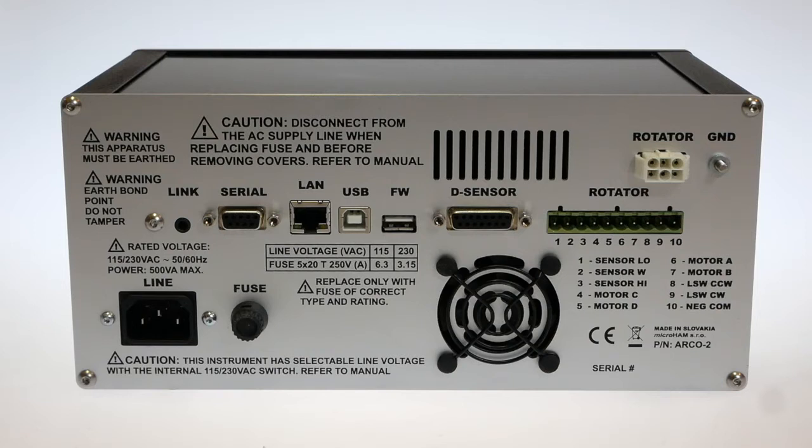The connected motor is driven by a 4-channel PWM driver providing soft start and stop ramps for both AC and DC motors. The rotator port supports pot sensor, rheostat, reed contact, PWM encoder, or Hall sensor. All wires on the rotator ports are physically disconnected from the controller when it is turned off or in standby mode, in order to protect internal circuits against damage during storms.